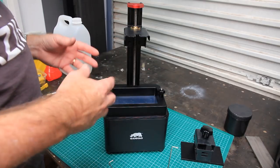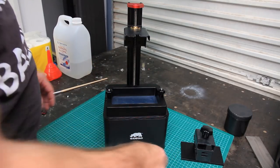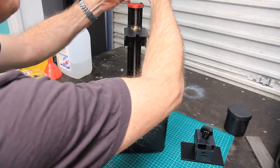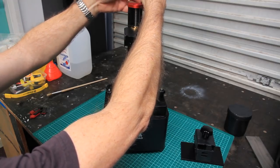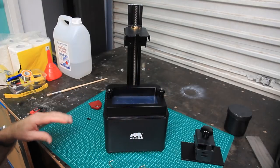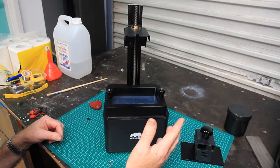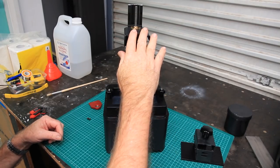what I've done to this machine, from a sort of troubleshooting perspective, is as I showed you that connector, and what I also did was when I was printing all those items for the awards, I actually had this stabilizer removed from the machine. I've since reinstalled it. And I've reinstalled it because I've trued up this rod here. Now, when I was setting this machine up, and I was doing some manual jogging on the machine, I was raising and lowering the platform here.